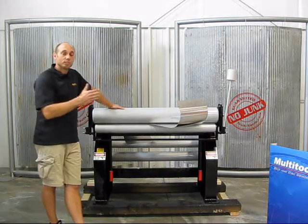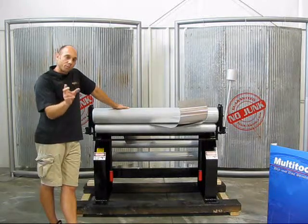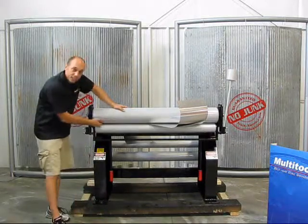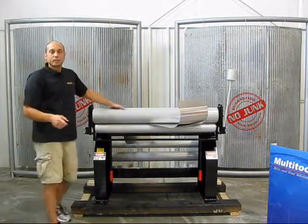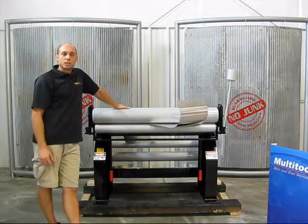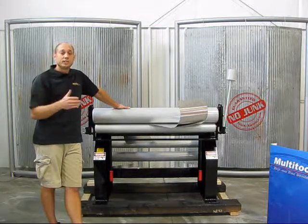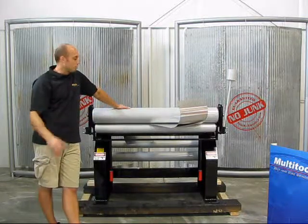We talked about capacities at full length. The question is: can you do a thinner or narrower piece of material at a thicker capacity? Yes, you can. So if you want to make a bracket out of, say, quarter-inch material, coming down to the end of the machine with a narrow piece of material, we can make brackets beyond the capacity of the machine at full length. Check the website for more ideas on what's possible. You're not necessarily limited to that 18 or 16 gauge capacity if it's a narrower piece of material — that gives you a lot of flexibility to make cool brackets and smaller parts as well.